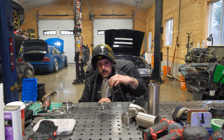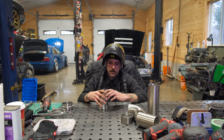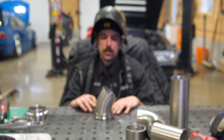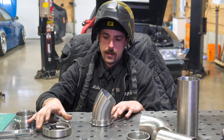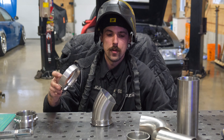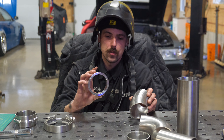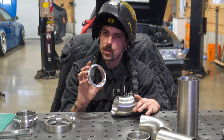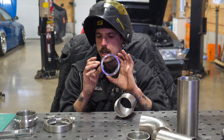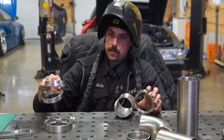We're back at the bench. We got some tubes, clamps. I already know this 45 is going to work perfect — this is probably the only nice piece that came with that flange assembly. We're going to tack our 45 bend to the V-band flange that will then clamp with a good clamp on the back of the turbo. Because we need to take stuff on and off, you want good quality components. Use a nice clamp, use nice V-band flanges. This is the proprietary flange that comes with this turbocharger — a lot of turbochargers have different flanges.